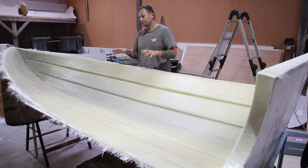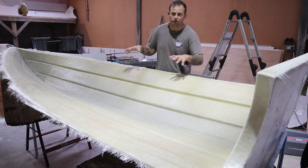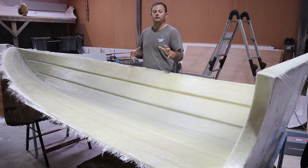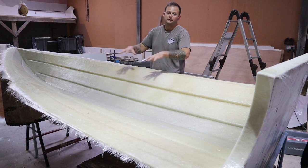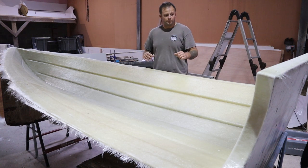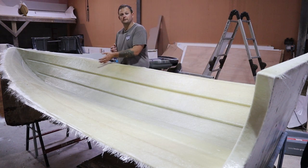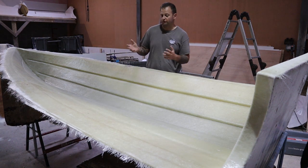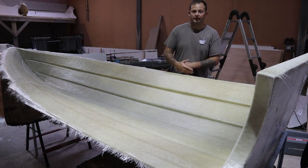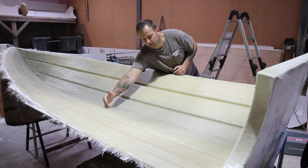So it's not often you'll see a woven on a finished or a cosmetic area as such. So you always try and trap the woven inside something so you end up with the matte fiberglass finish that you see here, okay? So these were pretty much done in one run. There's a slight stagger of a join here in midship just because of the length of the material and roll we had available, okay? So they went from the outer flange here, rolled in, and actually ended on the other side of the chine here, okay?